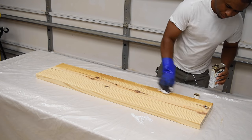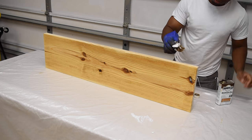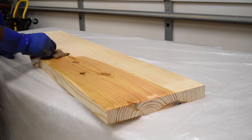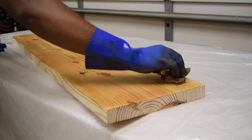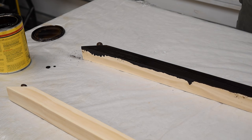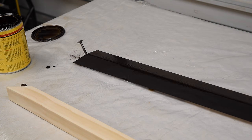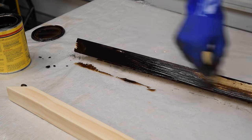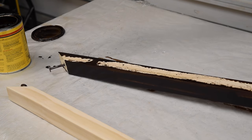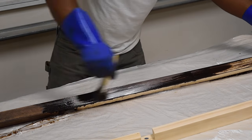Eventually I'm going to donate this to charity, and since I don't know others' taste I wanted to keep it neutral, so I went with a light walnut danish oil. I'm a big fan of danish oil because it soaks into the wood and the dry time is really fast. You can add a second coat if you want, but I usually leave one coat since that's a good enough tone for me. For the frame I went with an espresso stain, which is really dark. I didn't want to use paint because paint adds another layer onto the work surface and I didn't want any alignment problems or paint coming off when removing the cross support. The espresso was simple to apply — just brush it on and wipe it off.